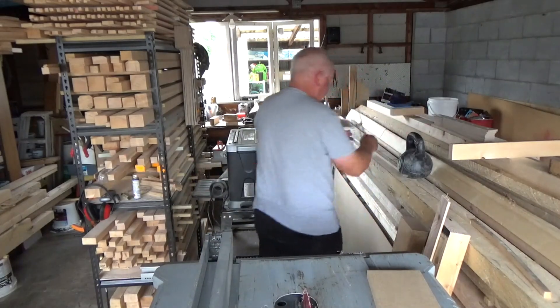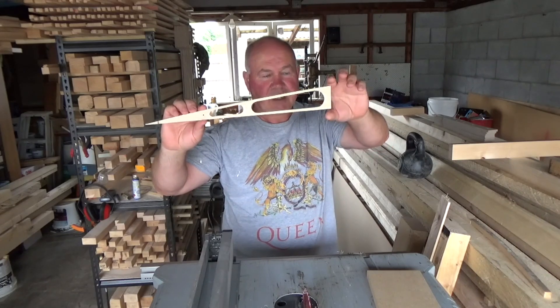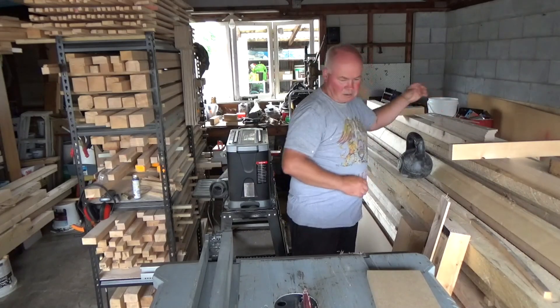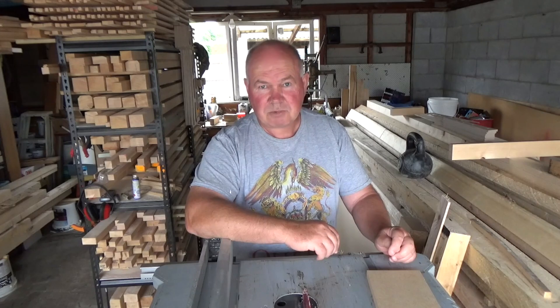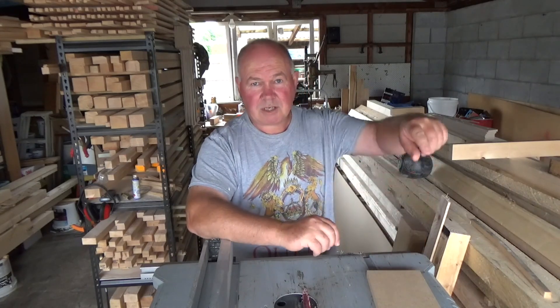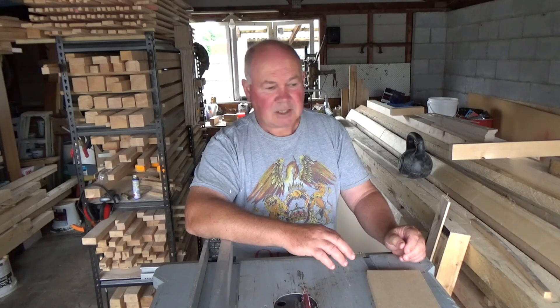This is where I've got to so far with that, but I can't use this one because I changed the dimensions here. In particular, I've shaved off the bottom and now I've got to redo that jig. I've re-stacked the stack of timber so that now takes up less room and I've got more space in the shed. I've also re-stacked timber within the shed to make better use of the space and to try and make sure I've got fillets of wood between all the drying timber. The timber is pretty much dry — it's there or thereabouts. But I'm getting cracks still on the front faces and sometimes down the lengths of the timber. That's all part of the issue of moving from Wellington to here where the climate is radically different. We're still paying the price for that.